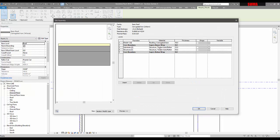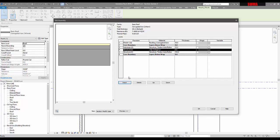The way it's made up is it's got some very thin joists, maybe a little bit too thin. I would probably say that for something like this span, you could get away with 150, hopefully, and depending on how you want to insulate it, because if it's a corrugated iron roof, it's going to be pretty noisy. You'd want to have a fair bit of insulation and plasterboard in it. So I'm just going to add a couple of these into it.